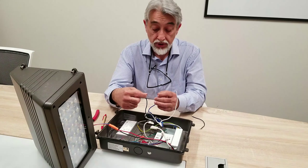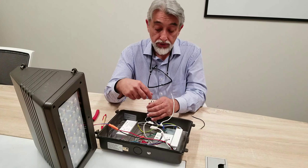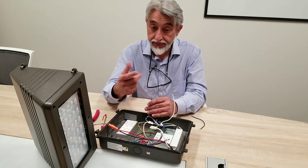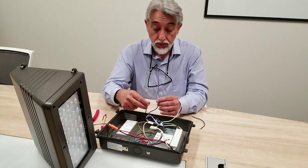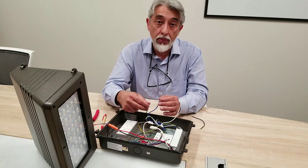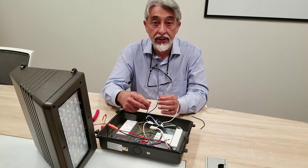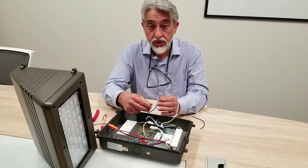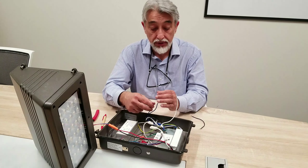You're going to use this to connect your unit. In most cases, these wallpacks are either going to a photocell that needs to switch it on and off, or a timer. What we're going to do is connect two powers to this — one switched and one constant. It will operate the battery backup when the constant is off and the switch is off, and the switched connection will turn on and off as the switch controls the unit.